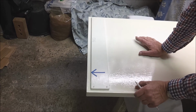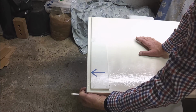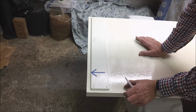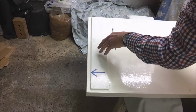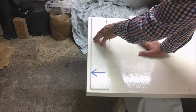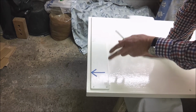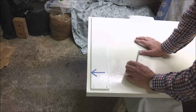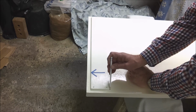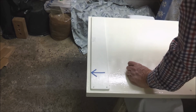And to check how deep the frame is, look on the end of the door and you'll see a joint there. And in this case, it's something like 30 or 35 millimetres, no more. So we have to fix the plywood on the face of the door so that we can fix our restraining blocks that we've just been designing. And this plywood board, which is 9 millimetres thick, is screwed with screws that go at an angle like that, so that they're sure to bite into the flimsy bit of frame that we've got. Same at the other end.